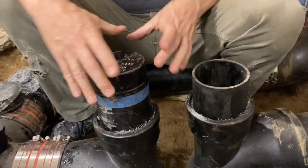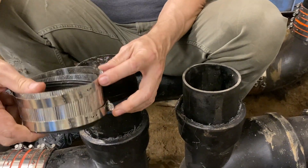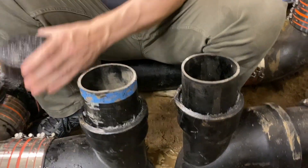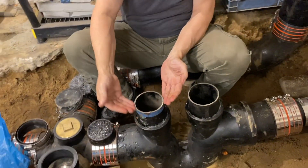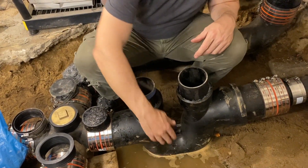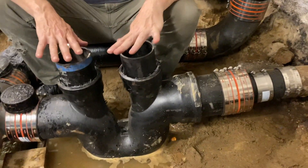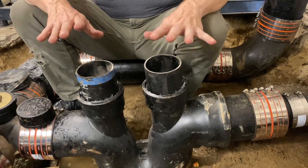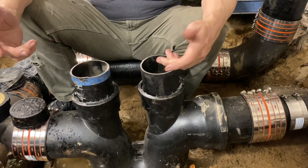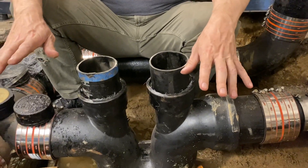A four-inch cast iron plug with a no-hub coupling that anybody can open and close with a nut driver. These are long enough to get above the concrete, short enough to put a gloved hand in the trap, short enough to make a turn with a snake. This is a forever solution — no rats, no water jumping out in a flood, nothing else to do, at least for the rest of my lifetime.